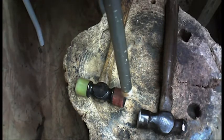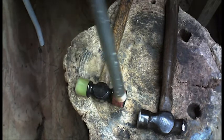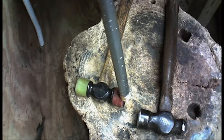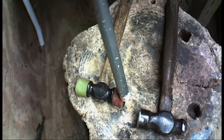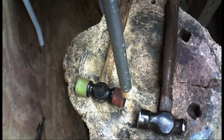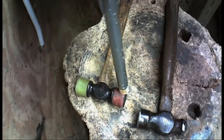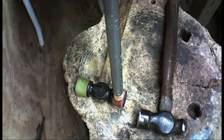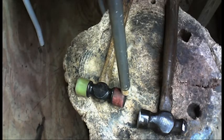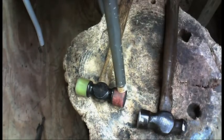The second kind of hammer I'd suggest is a soft rubber-ended mallet. The soft rubber end is primarily going to be used for dishing - that's what I use to make the plates when I do the dishing. It will do the dishing without adding a bunch of marks and dents to the metal, so it's less work. You may have to hit the metal a little harder and make a few more passes, but in all honesty this is much less work than having to get all those dents out.